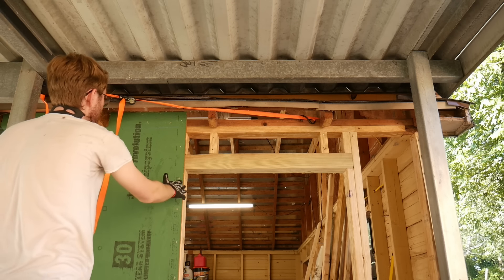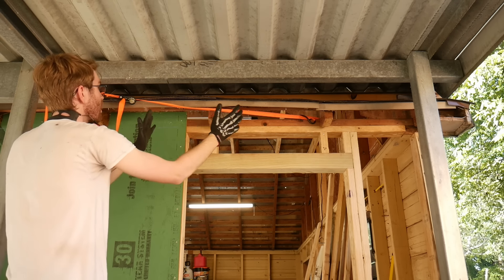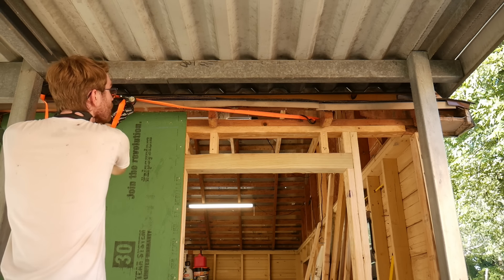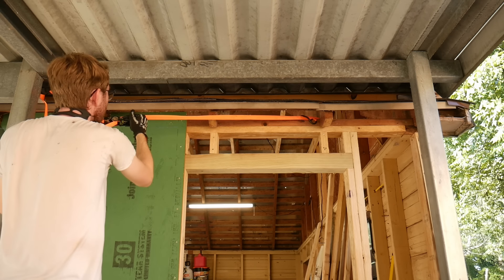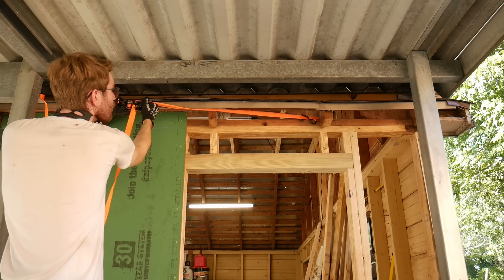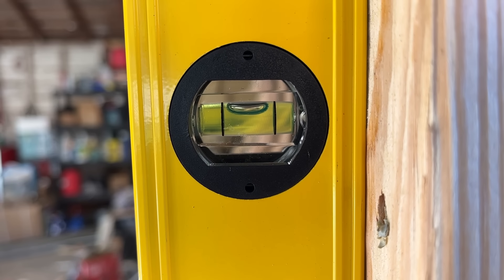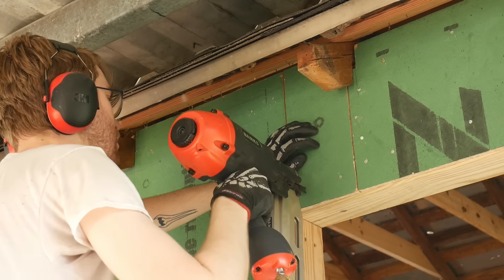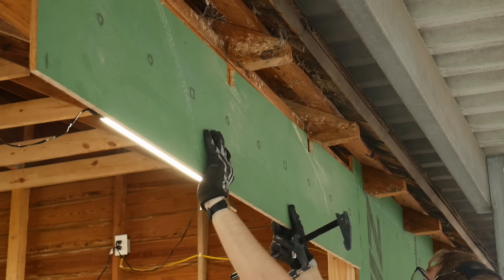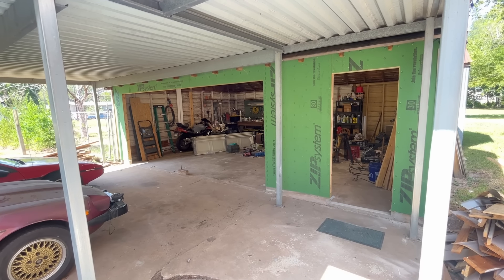With the diagonal brace, the sheathing installed, and the other two ratchet straps still on, the top plate and the entire roof should not move when I release pressure here — or at least that's the idea. Well, the carport definitely moved, but is the wall still good? The bubble's still between the lines, so that's good enough. Even if it is a fraction of a degree off, it's still way less than it was, and the building is now actually properly braced. Or at least one wall is.